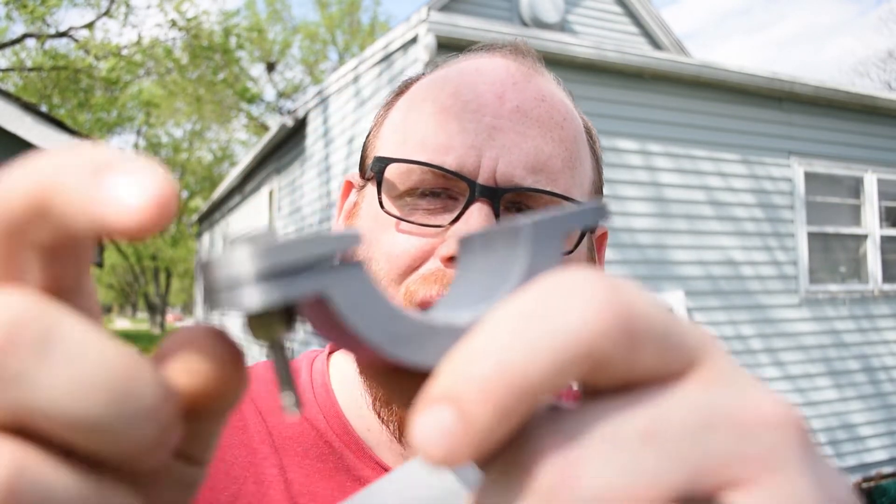So I've swapped out the filament, I'm doing additional walls, and hopefully the new one will hold up better. What I think happened is I put my bike away in the garage after I set this all up and tested it, and it was fine. I think the ambient temperature of the garage, which tends to be a little humid because the roof is leaking as I mentioned in an earlier video, combined with the quality of this filament, just caused it to contract and snap apart.